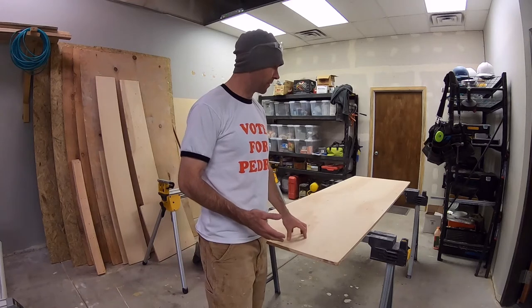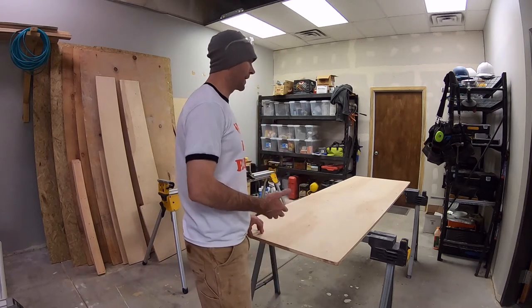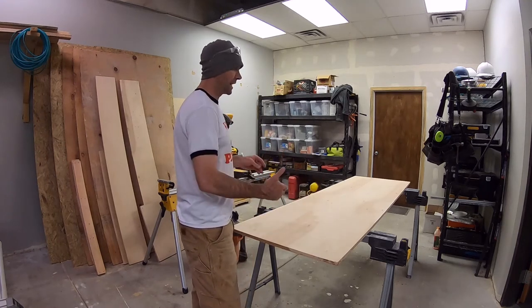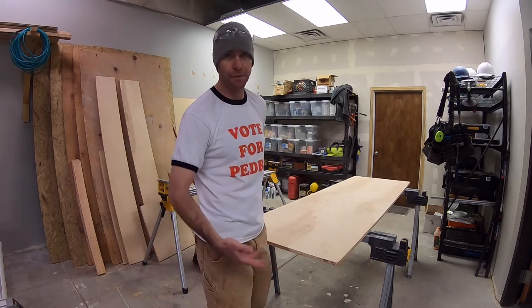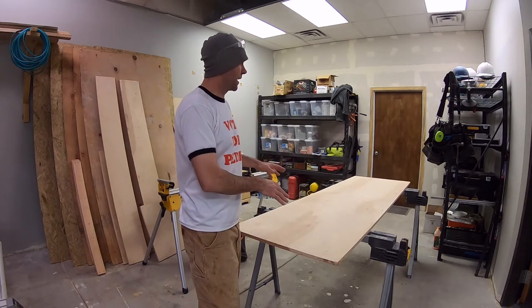You're cutting off of lumber that you're assuming comes out of the mill and out of the shop squared, but not always. A lot of times, I will go ahead and cut my dimensions first and then come back with whatever I need. If I leave a little bit of extra, I'll go ahead and square it up with a chop saw, table saw, whatever I need. Sometimes a Skil saw, like you saw me do before. So anyway, got to cut the length, got to cut the width.